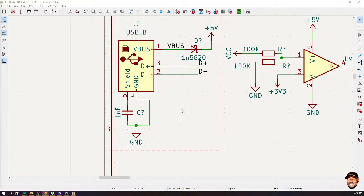So, you are saying the TVS just absorbs the extra voltage? It's not quite absorb. The way they operate, when the extra voltage comes, yes, we can say they absorb, but they shunt it. When we say you are shunting something, they redirect its effect so that it doesn't affect our circuit. Something like that. Okay, thank you very much. You're welcome.